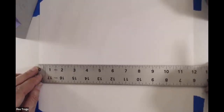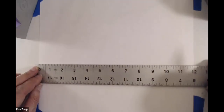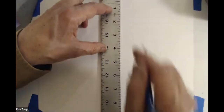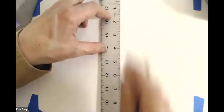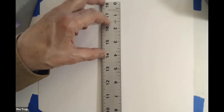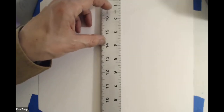At least, even though I don't draw my title block, I will at least center them, top and bottom, etc. So that's 1 inch, half inch on the bottom again for the border, and then 3/4 for the title block, and that gives us 7 1/4. Is that right?